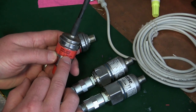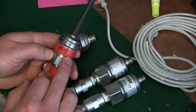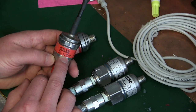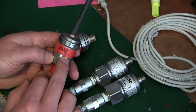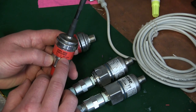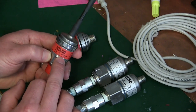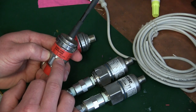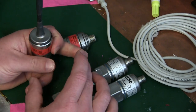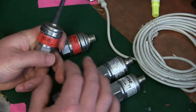We can see here this one inputs 600 psi gauge and it will output 0.5 volts to 5.5 volts depending on the pressure. So full scale 600 psi on the input would output 5.5 volts. How it does that is it has a Wheatstone bridge and a sensing element.